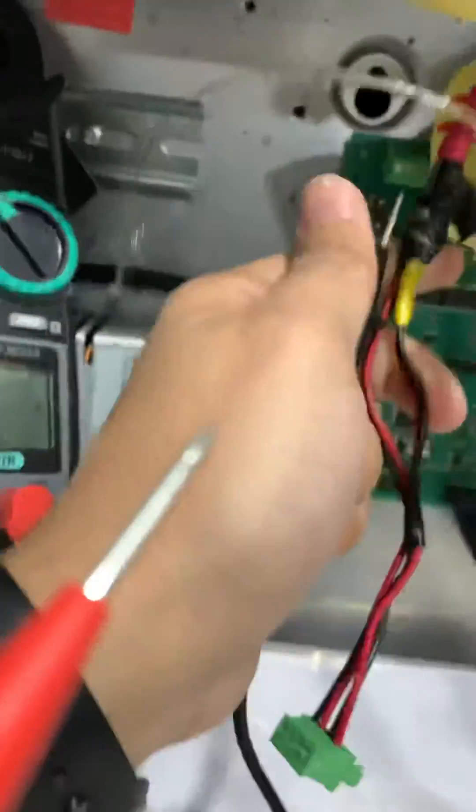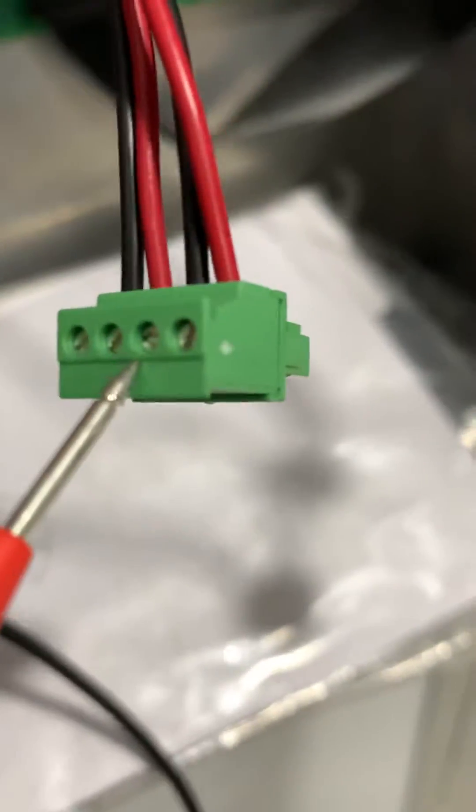The black is okay, but the red wire is shorted with the earth in this loop. In another loop it seems okay — there is no problem. So, how do you detect this? Try to split the loop.